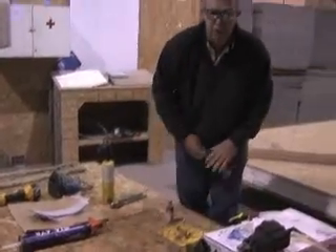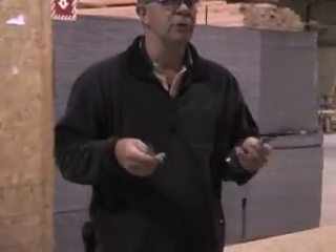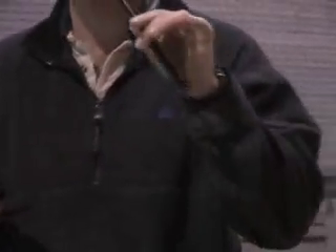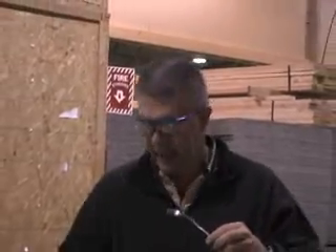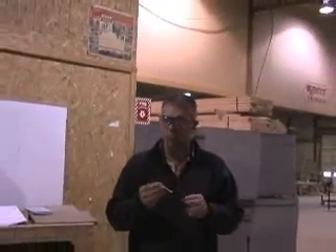We also use as installers what we refer to as spoons or panel spoons. These work very well because of this flat bar — it allows us to get in between lumber and the edge of a panel skin and tweak it or pry it together, so when we're pulling panels together and something binds and doesn't want to come together, we can work it. This heavier one is for the young guys; this lighter one is for me because it doesn't wear me down as much.